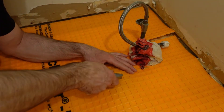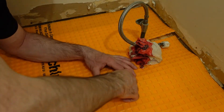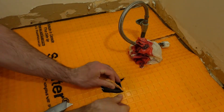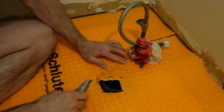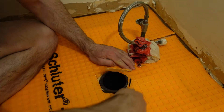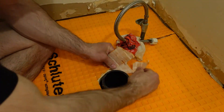For the toilet flange, I'll just place the DITRA where it's going to go and then cut around the toilet flange with the utility knife. Pretty simple — no measuring really required — and I'll keep it nice and tight to the actual PVC pipe. I found cutting through the plastic was quite easy; it's the mesh on the back that's a little more difficult to cut through.